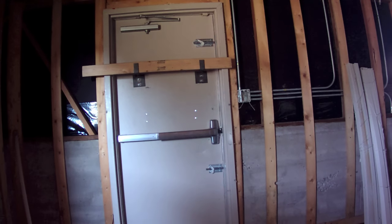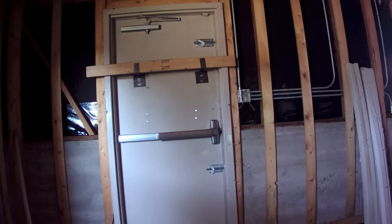We started with conventional forcible entry for a couple of reasons. One is so that we can get the Halligan set and pry outwards to see if the drop bar is even in place. If it's not, we easily defeat the panic bar in a matter of 30 or 45 seconds. The other reason is so that we can get a pry on the door and feel what we're going up against and if we have additional locks in place.